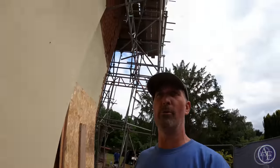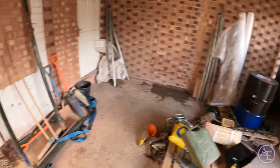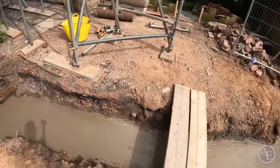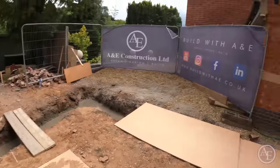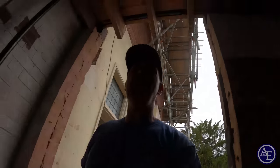So guys, we've just wrapped up. We had about a barrel of concrete left — it doesn't always happen that way, sometimes a little more or a little less, but we've been able to fill this hole and that one over there. We're just tidying them all up, covering the top of the footings with sheets in case of rain tonight. It's all levelled off, all tamped all the way through, within 3-4mm all the way around — really pleased with that. We're going to finish off with the fly sheets, run them around, and then it's time to pack up, go home, have a beer and a Chinese, and chill out for the weekend. Have a great weekend guys — see you on Monday, take care!